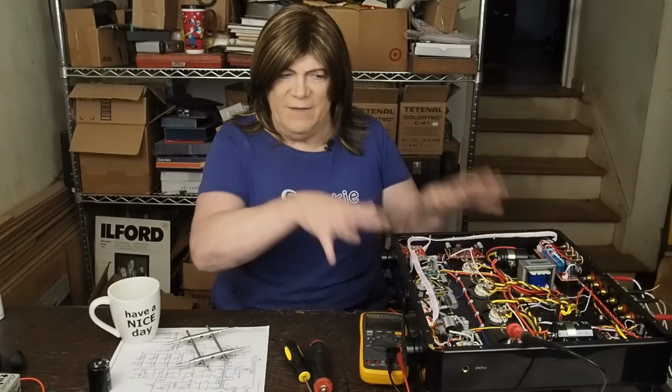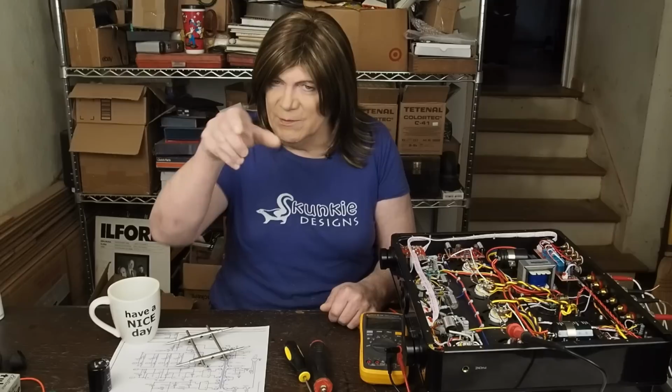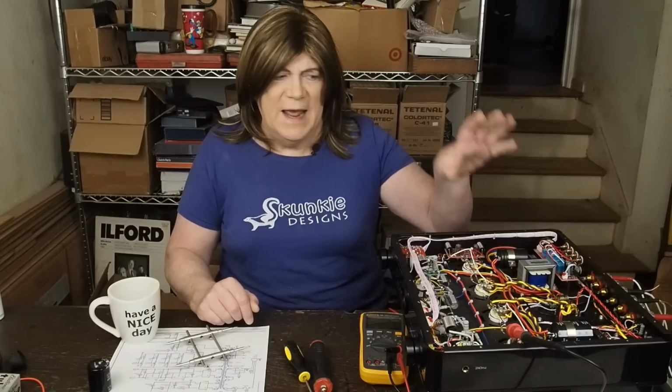That said, after doing this work, plug the amp back in, the little bit of hum, and again, guys, I'm not talking about a brrr kind of hum. This was a very, very tiny bit of hum at the mid volume point that you had to put your ear just up against the speaker to hear. It's almost gone. It's made another level of silence from the amp, replacing these resistors, and I believe putting these twisted pair wires going to the power transformer is removing the AC noise inside the amplifier. And so that's a win.